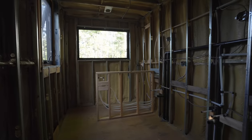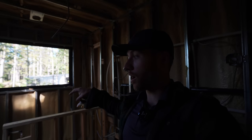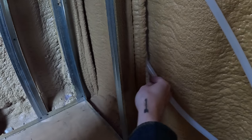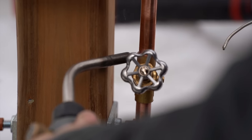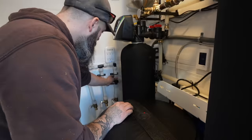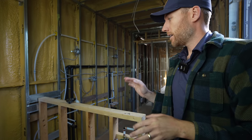This is going to be the shower for our bedroom. The lines right now are pretty far back in the cavity, and given the climate we live in, we want to make sure they're as close to the heated section of the building and not close to the outside — because in January at minus 30, all that cold air presses right against the metal and we have a risk of these lines freezing. By moving them as close to the drywall as possible, it will hopefully reduce that risk. Dave is just getting here now — he helped with all the plumbing with the dome and everything we've got done in here so far.